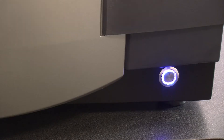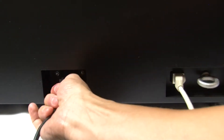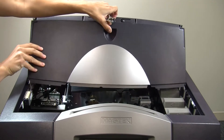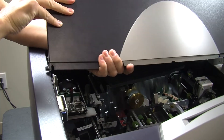Press and hold the power button on the front of the EC2000 and wait for the machine to shut down completely before you unplug the power and data cables. Unlock the top cover using the key. Slide the cover halfway, then gently pull out one side at a time so that the cover extends all the way out toward the back.